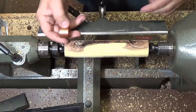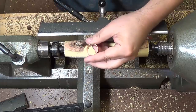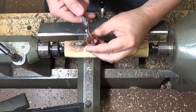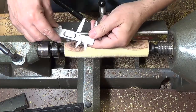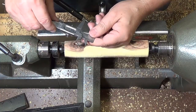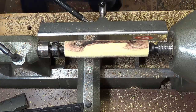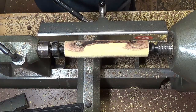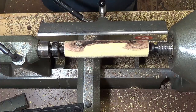The first thing I need to do is size this down to fit this ferrule, which I made from a copper coupling. The inside diameter on that coupling is seven-eighths of an inch, which is about 23 millimeters. So I'll get a parting tool — I'm going to get my bedan ready — and I can take it down quite a bit more with just the gouge.